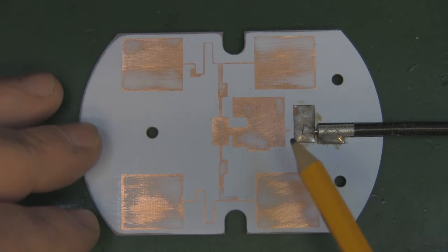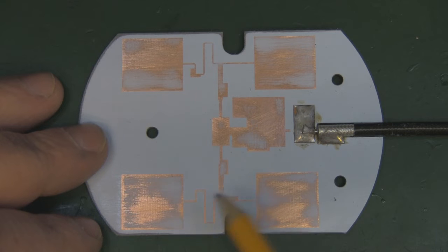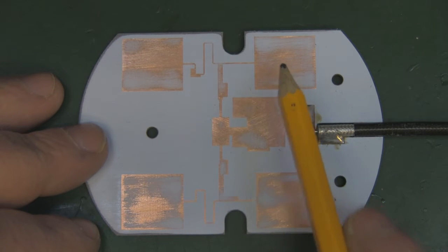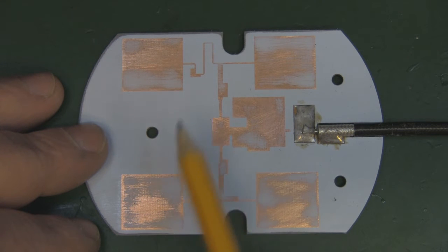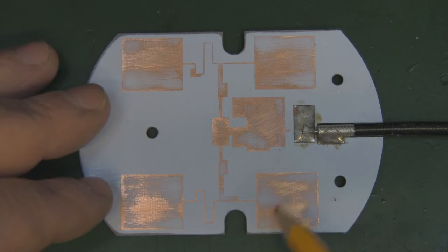But things don't quite add up like that when you're designing an antenna. So let's say this is 3 dBi, and we've got 3 dBi there. You can't actually add them together. You'll have a little bit of loss, and it would be nice in the real world if things doubled like that, but it would probably be just under 6 dBi with these two. And then as you start climbing up, it gets progressively worse. So if we call each one of these 3 dBi, for instance, you'd probably find that all four together added up would be around 9.5 dBi, let's say.